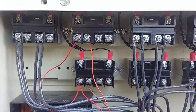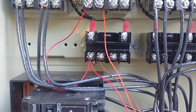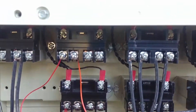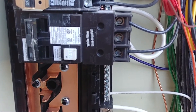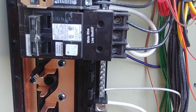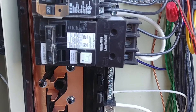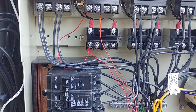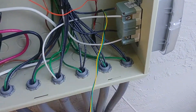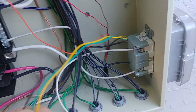As you can see, we're all hooked up. The red is our jumper, and the brown and orange ones are the speeds. Also don't forget the pump itself gets hooked up directly to a breaker — we're using a ground fault GFCI breaker for safety, and they also require that in the state of California. The wires that we are not using we're going to tape off or wire-nut off so they don't touch anything important.